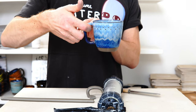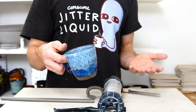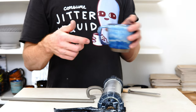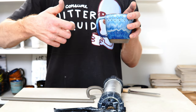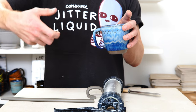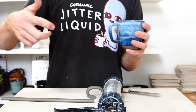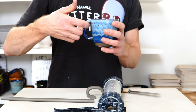If you design a handle where you have to have two fingers close together, you have unfavorable leverage and are forced to apply more force with those two fingers to hold it steady. Similarly, if you extend the handle way out you've doubled the distance, so you'd have to push twice as hard — and that's already three to four times the mass of the mug. Handle design makes a big difference in terms of the mechanics and how much force you have to apply.